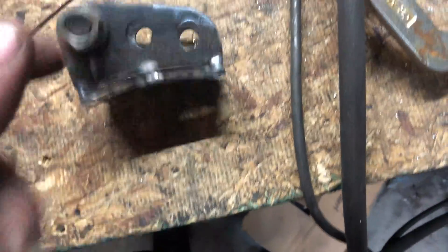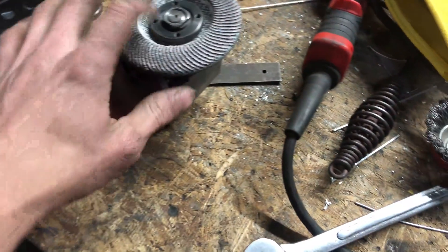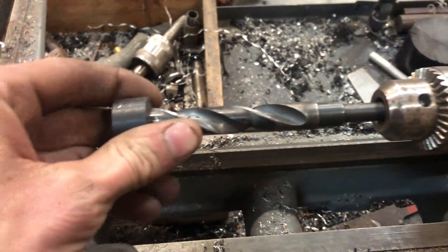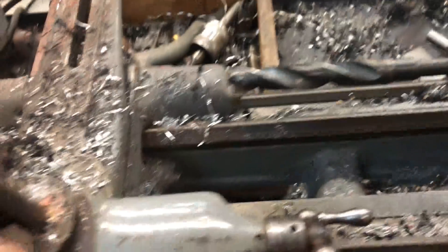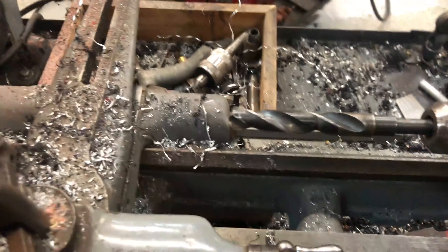The shape of these is pretty much all done by hand — just trace it out, rough cut it, finish it down, and it makes a nice little shape. Nice shapes make everything happy. Now I need to fill this little gap over here. For that I'm going to use my lathe and some Delrin. The Delrin is already drilled with a 9/16 hole down the middle, so I just need to cut two little pieces — about 0.2 inches, 200 thousandths if you want to be a machinist about it. I'm going to smooth out that face, cut it, and do that again.